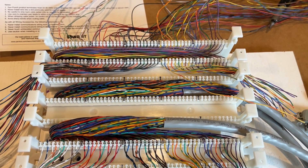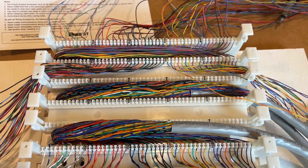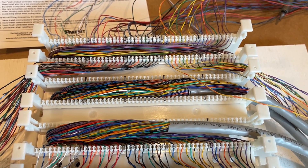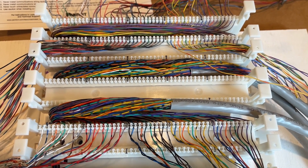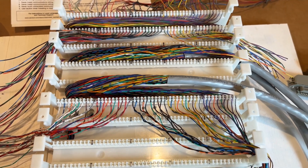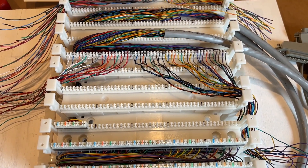With this laying on a counter, it's easier to actually fan out the wires before putting the modules on. Otherwise, you can create your own heartache by having stuff in your way. There are still several pairs to be terminated — probably at least 100 more cables. This is a 300-pair block, which will be a very mini IDF inside of the switchboard.